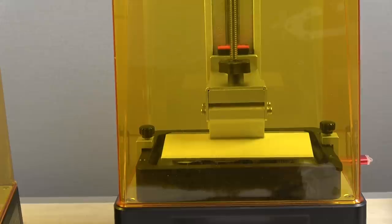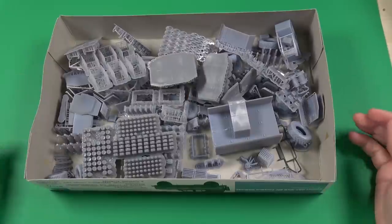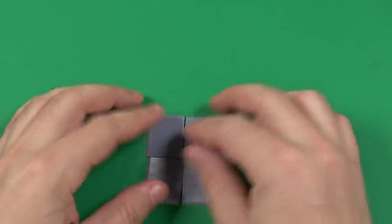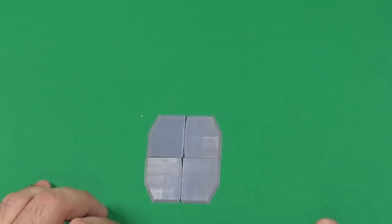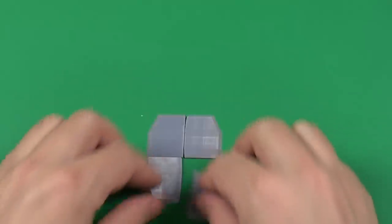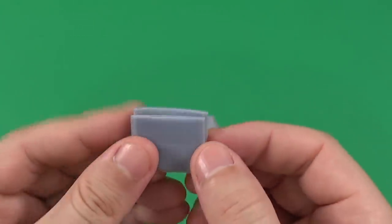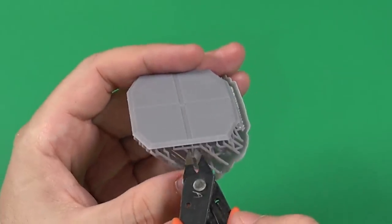About 11 or 12 sessions later, here is the box full of 3D printed parts. This is a good example of how SLA printing is still chaotic. These 4 pieces are from the same batch. I placed them on the plate at the same angle, but the result is completely different for each one. It's all about surface tension problems with busy batches. You should bring the print surface to the smallest possible level, or you should increase the number of batches and decrease the number of pieces.